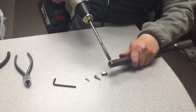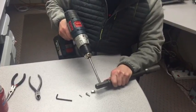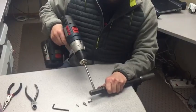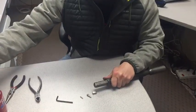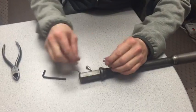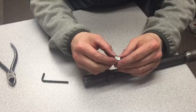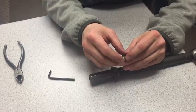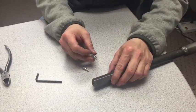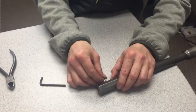We're going to go into the hole and ream it out a little bit, just kind of open it up in there. Then to reassemble, we're going to put the spring in first. You'll notice this cutout needs to face upwards, because that's what the set screw is going to catch hold of so that it doesn't fall back out — then insert that.